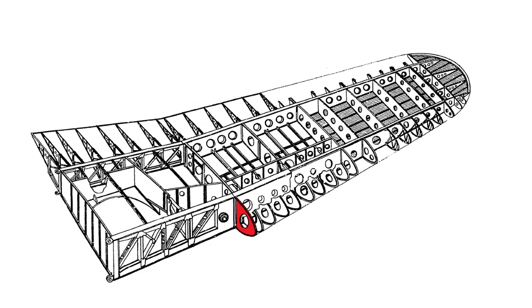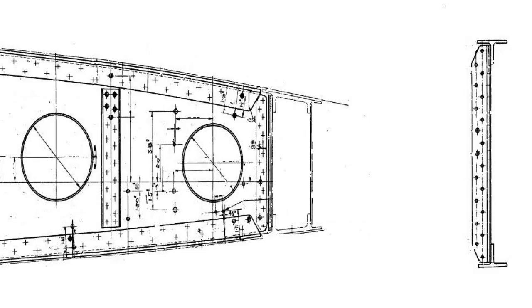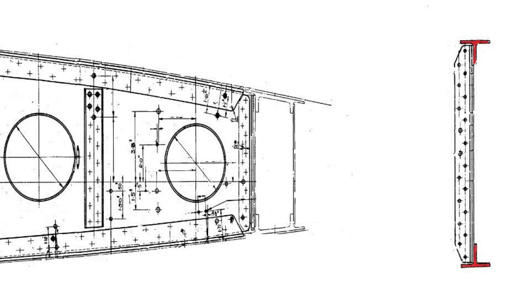It's a fairly basic construction but very heavy. Looking at the wing chord-wise, there are nose ribs, inter-spar ribs, and trailing edge ribs. There are six main very heavy inter-spar ribs that carry the bulk of the loads; once you get outboard of the gun bays there are some lighter ribs as well. These six ribs are all built of a web design, just like the spars, with an extruded member for attachment to the skin — again, very heavy ribs.